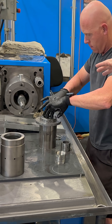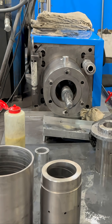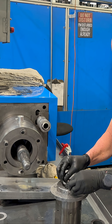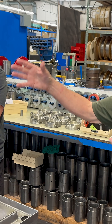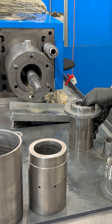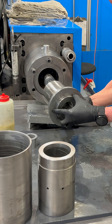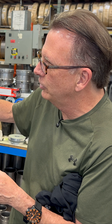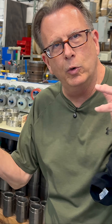This is all part of getting that ring light tight like we showed earlier. This is an OD lapping machine. Jeff right now is setting this up to have a set of rings come in — very, very oversimplified, this is a big horizontal butter churn. It's going to load up with a set of rings. It's got a cam or a wave plate in here depending on the angle that we want to put on it. We're going to lap the rings and wear off any of the imperfections in the ring and make that ring light tight. This is part of building that 100% light tight ring. We have multiple stations to do this, but Jeff's setting up one of the OD lappers right now.